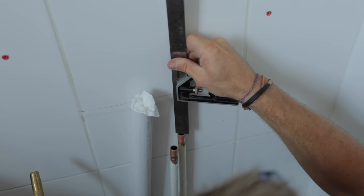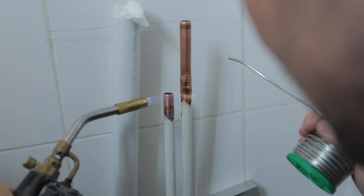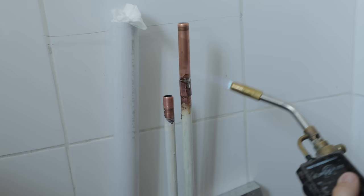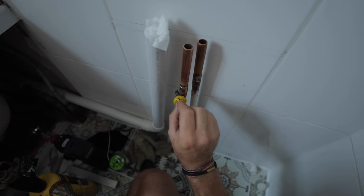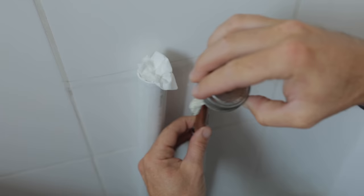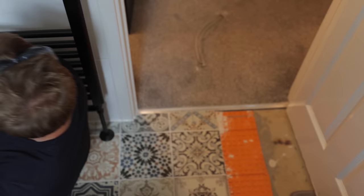They're going to try and bring them up roughly the same. I love this thing so much. Heat the bottom one up first if you like. You can pop a little bit at the top. Usually you don't have to worry about heating both sides on 15mm. Just get it running in a bit like that. I've cocked it up, but hey — it just has to not leak. That's its only job in life.